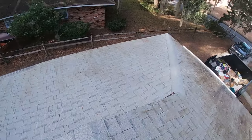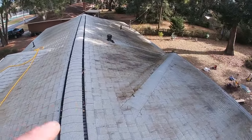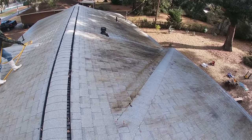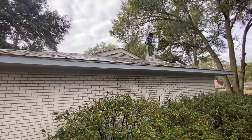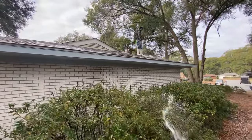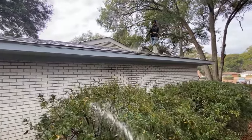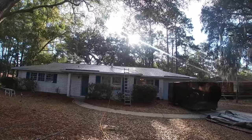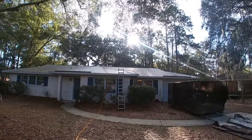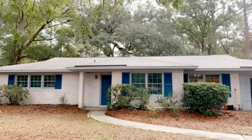Come and hit this one little back section right here where they're still black — might as well get all that chemical out and put it to good use. One of the main reasons that we don't like to rinse roofs is it increases your time on the roof, it increases the amount of runoff, and that's good chemical up there that's still working — that's typically why we don't rinse all the time. Most roofs don't need it. This is a night and day difference, a huge beautiful transformation, increasing the curb appeal, prolonging the life of the roof. It is basically looking like a brand new roof.